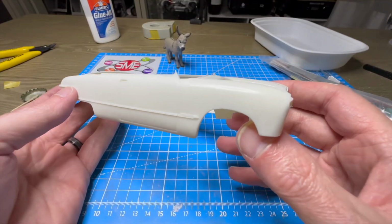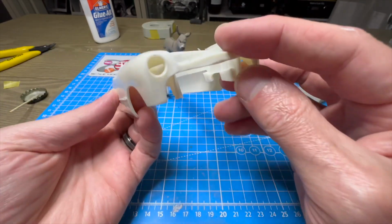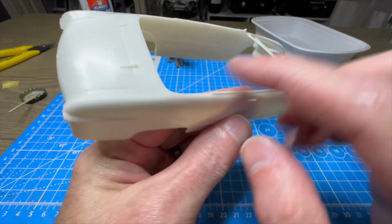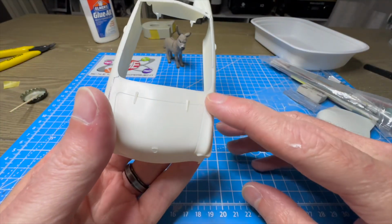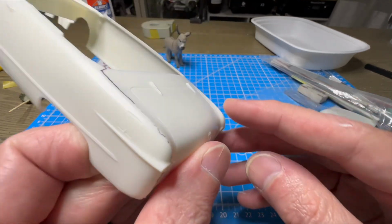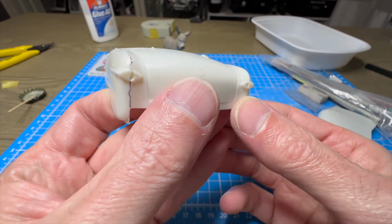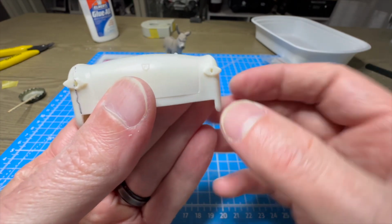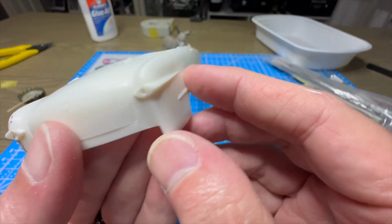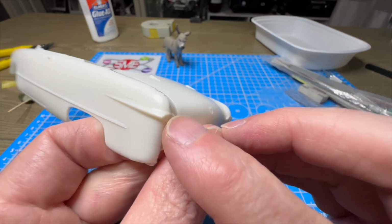After a lot of sanding, this side is done. This is smooth all through here. This is especially, you gotta take care of this. Over here, that's a hard lip. And I just rounded it all out so that it's a smooth hump instead of a peak. Be careful here. There's a mold line right here you gotta take care of. And then here, you wanna round this off as well. This is a sharp peak over here.